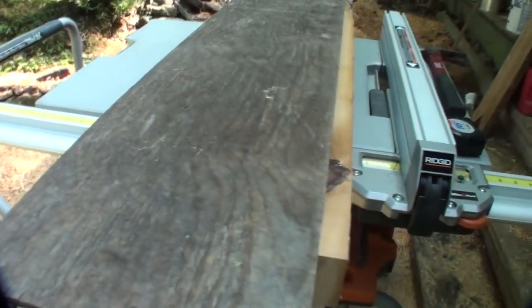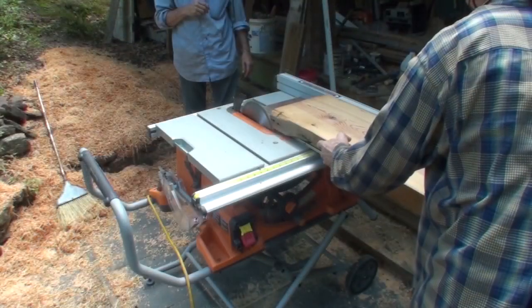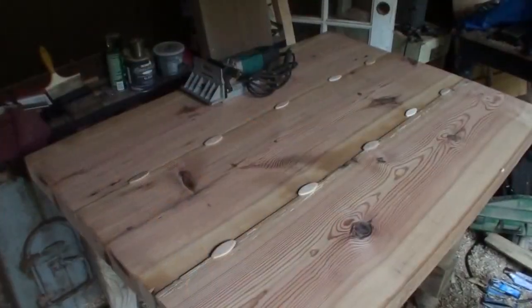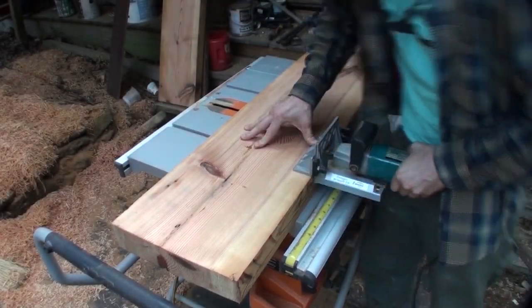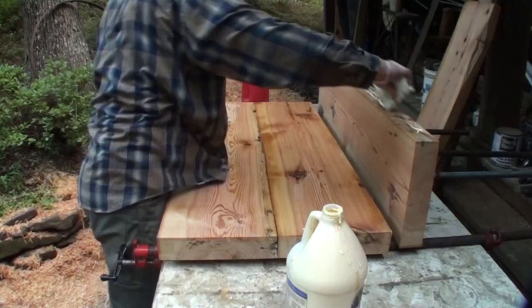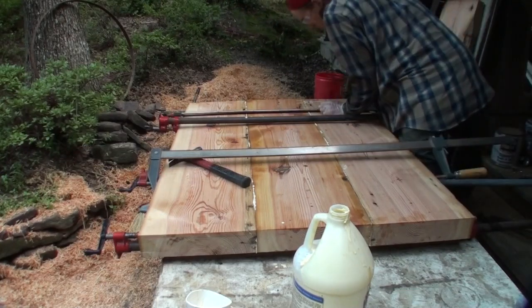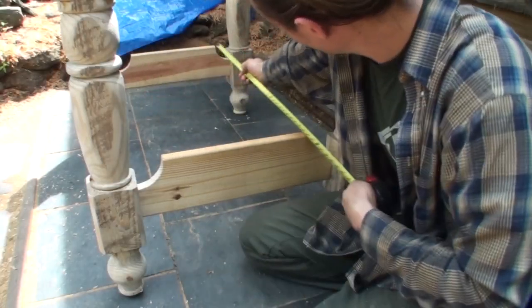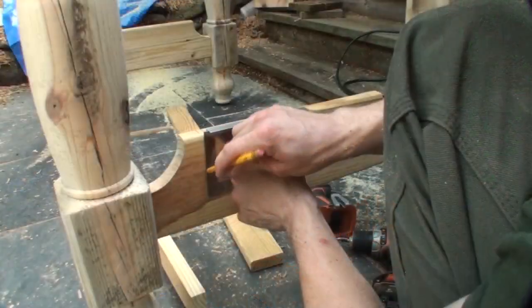Once those boards were cut to length I had to join the edges. I wanted to try a different technique — not on the jointer but on the table saw by straight ripping them. I used some roofing nails and nailed them to a piece of plywood that had a nice straight cut on it, let one side hang over, and the other side rode against the fence. It worked out pretty well, though I did have to go back in and hand-tune it with a hand plane in some areas. I did some biscuit joints between the boards to help align them so the tops don't shift out of place, using pipe clamps and bar clamps and wiping up all the excess glue.